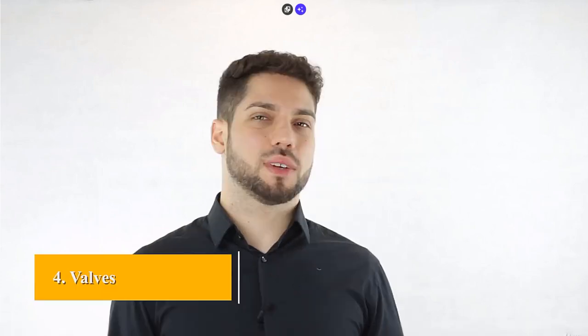Now that we covered what a pneumatic actuator is, how it works, and how to think about it when choosing the best solution for a given task, let's see how we can control it. As it isn't practical to insert a tube to power one stroke, then to take it out and power the other one, the industry has provided the solution in the form of a valve. To be able to have tubes inserted in both chambers at the same time, something has to switch between, providing pressure alternatively. For a start, let's think about it like an on-off switch.